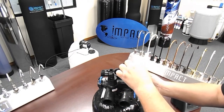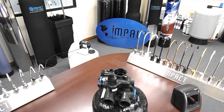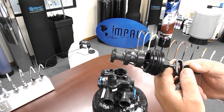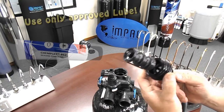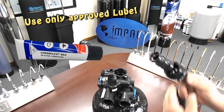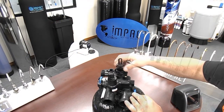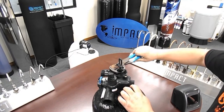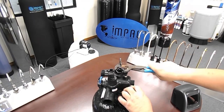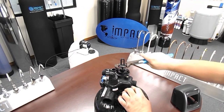Install your new seal and spacer cage, noting that there is no up or down. Install a new piston assembly, being sure that it is thoroughly lubricated on both the piston, the piston rod, and the o-ring. Also make sure that you are installing the same type of piston, usually indicated by either a white, yellow, or blue dot. Use channel locks to tighten the piston nut — do not over tighten.